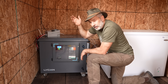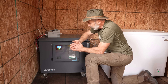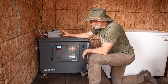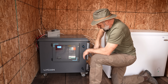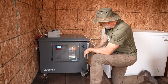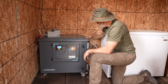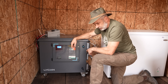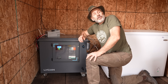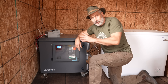Being fully insulated, we can actually run the freeze dryer in here and have the temperature about right for freeze drying. It's surprising how little power the freeze dryer uses — this thing can easily provide that. Because we have multiple outlets needed, and this has only one AC plug on it, by having a sub-panel I've already run the wires down to the cellar. There's an outlet down there to plug this in, two lights, and in here we'll have at least one light.